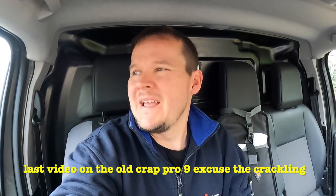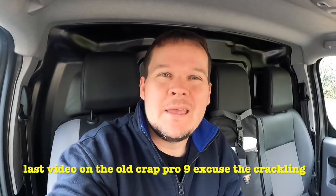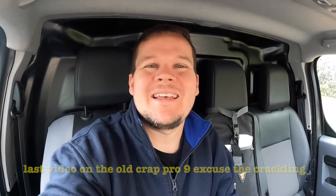Morning everybody. Today we are going to install a 22 kilowatt zappi. What else can I tell you? We're putting in a 6mm 5 core with a separate external duct grade Cat5e for the CTs, three CTs. I need two cores each, okay, so that'll give us enough cores.